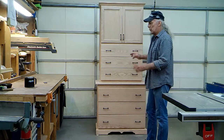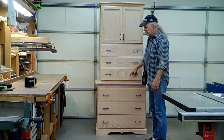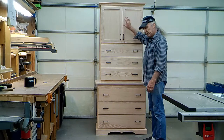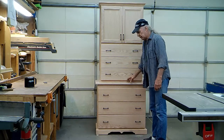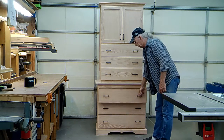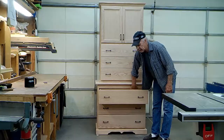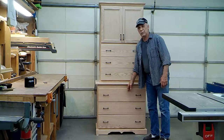As far as how the cabinet works, there's a throttle cable that activates the latch in the mechanism. It's channeled down into the lower cabinet, and above the top drawer is a lever that when pulled deploys the trays and gives you access to the concealed compartment.